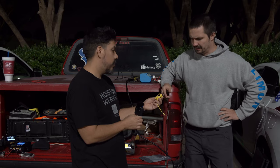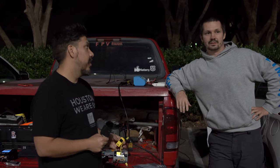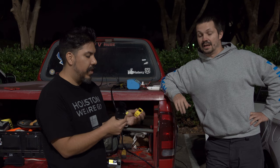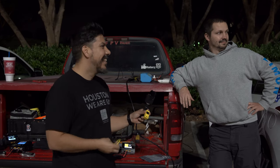It has a voltage reader — when you plug in the battery you can see what your battery voltage is, and you can even power it from a tiny whoops battery. They should figure out how to use the real configurator instead of making their own configurator. How does it connect to your phone? Bluetooth. Maybe Betaflight one day will support Bluetooth too. The old one used to take a few seconds to connect — this one connects right away. Bluetooth is a big deal especially since some flight controllers these days have built-in Bluetooth, so you don't have to open your quad. For best practice, bring your laptop with the full Betaflight configurator — but if you don't want to carry your laptop, carry this, but only if you have BLHeli S ESCs.